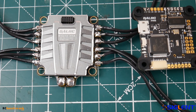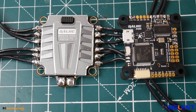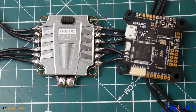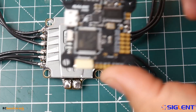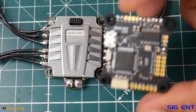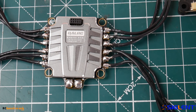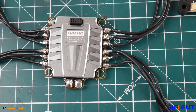Overall I truly believe this is going to be a very good stack, especially for new people. You just stick it right in and you're good to go. It cuts down on soldering — especially if you don't know how to solder. The pads here are big. You only need to solder camera, VTX, and receiver to this board. The motor pads are huge as well, so if you're not great at soldering it'll be a bit easier than dealing with smaller pads. I've gotten a lot of people emailing me saying they love it, so we'll just have to wait and see.